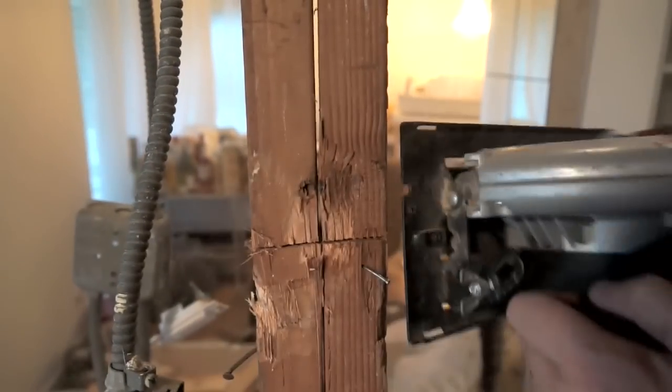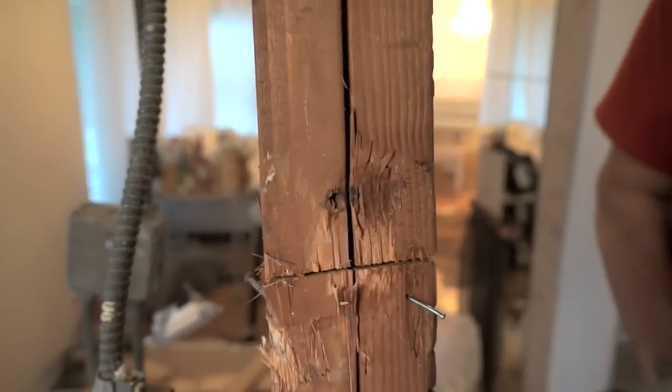You may also come across a heat or cold air return vent, like I have down here — you've got to deal with that and replace it. Keep in mind that when these places were built 50 years ago, various homeowners over the years have come in and done their own thing with no plans, so a lot of this is a case of seeing what you have as you go. In fact, I found a wall facing the outside with no insulation — bonus! As I pull off this old pine paneling, there are several walls exposed to the outside with no insulation.